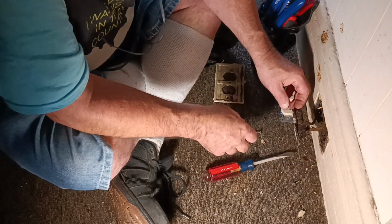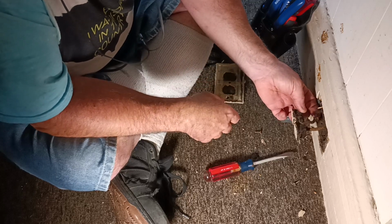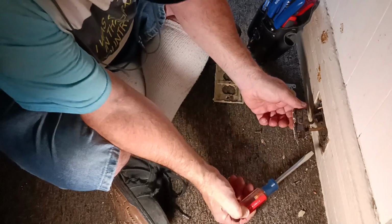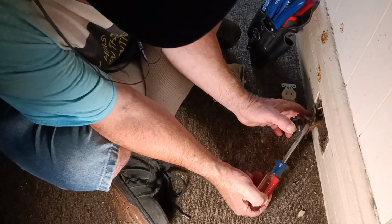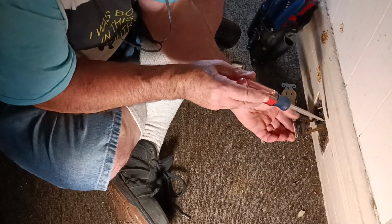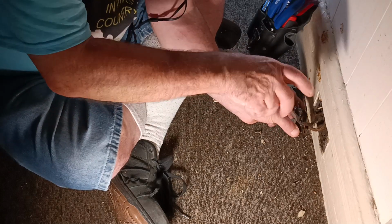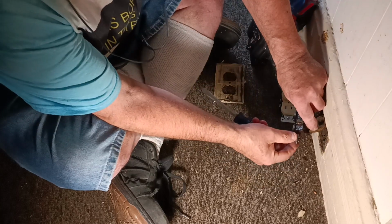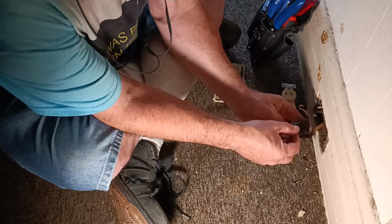Okay, this is older wiring. It was probably put in like 50 years ago. And look, they left a lot of bare wire behind here. So here in the country I was born in, to identify the live wire, see the four black tracers there? That's your live, and this is solid. And this was white. I'm going to guess this wire is probably 50 to 60 years old.